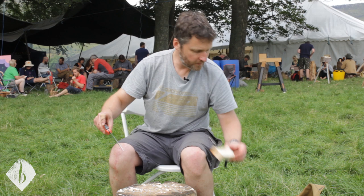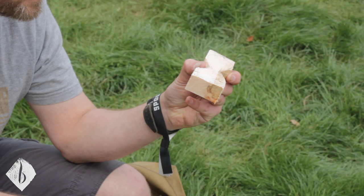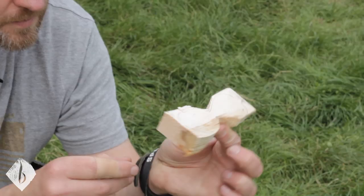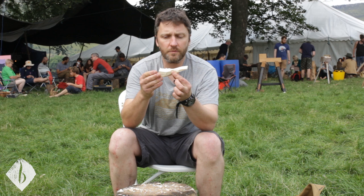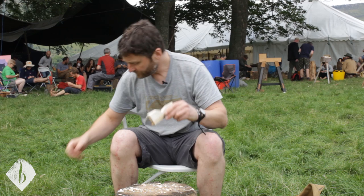You can put a saw cut across the bottom of here and build your cuts up to it if you really want to be super safe. But what I normally do by now is just to cut it off and separate the two. So that one will come back to another day. So it's got this odd looking thing now to do something with. If you wanted a super deep scoop, you've got the opportunity to produce that. I quite like a shallow one, a bit like a tablespoon really - you can still get quite a lot on because they mound up with coffee grounds and sugar and what have you. So often thinner than you think is the way to go.